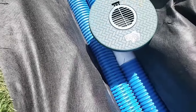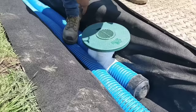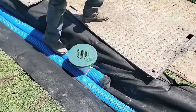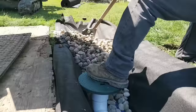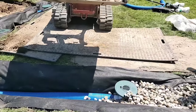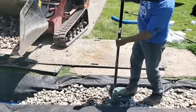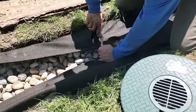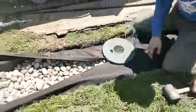You can see the eight-slot pipe has holes 360 degrees — on the bottom, the sides, and the top. You can see that directional tee. When you put this system together, make sure you don't leave the inlets too high. If the inlets are too high you're not going to collect all the surface water. You want that inlet at dirt level — not turf level, but the actual dirt the grass is growing in. It can even be a quarter inch below dirt level. Keep it on the low side so it can take in all that surface water.